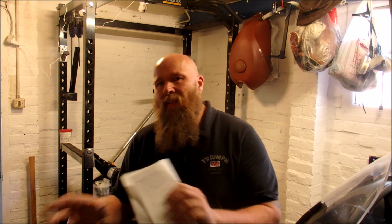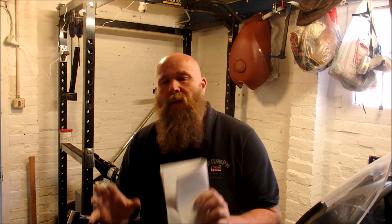Okay guys, the technical stuff. Now when you first start looking for welders, you are going to be interested in a couple of specifications which you'll keep your eyes open for. So you watch any of the YouTube videos, and they're all going to mention a couple of things that you need to be aware of. And the first one is amps. So where the amps are important is when it comes to what materials you're going to be able to weld and what sticks you are going to be able to use to do that welding with. So if 100 amps is the maximum your system will put out, potentially you're going to be limited to the sticks that you're able to use with that system.